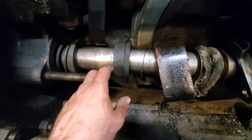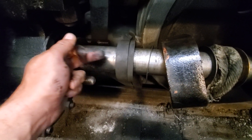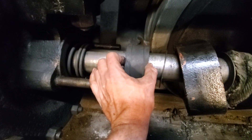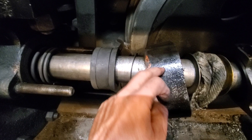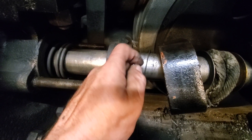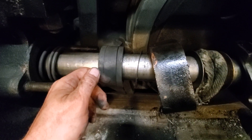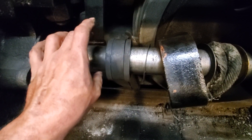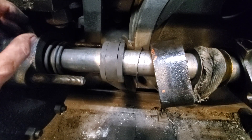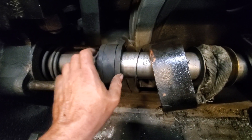How this works is that this packing is hugging the piston rod, so it's not going to let any steam pass by. However, steam is on the outside of it, and because you've got these washers here and the spring pushing all this against the cap, it makes it so steam on the outside can't get between the gap between this washer and the cap to work its way around and get out. And because this rod will move a little bit up and down, back and forth — not supposed to, but it will — because there's clearance between the piston and the cylinder itself. So you want to be able to accommodate that, and that's what this arrangement does.